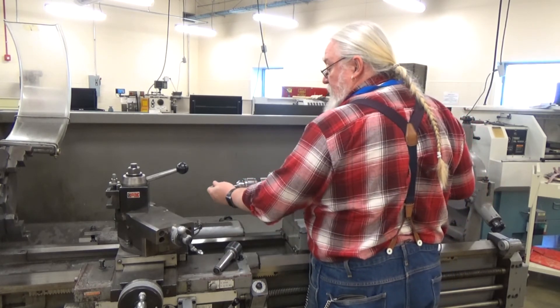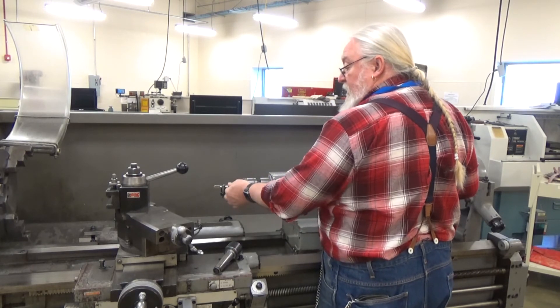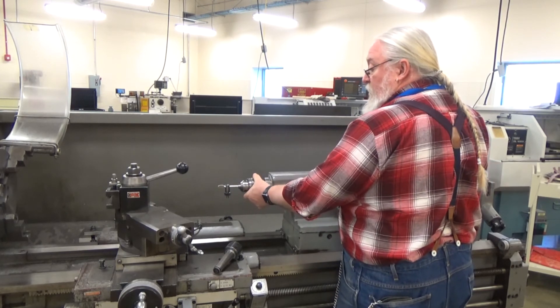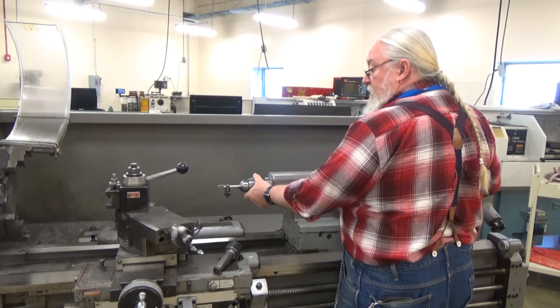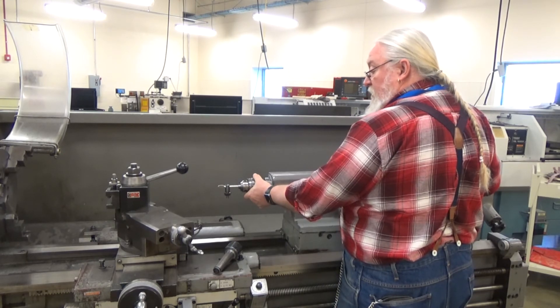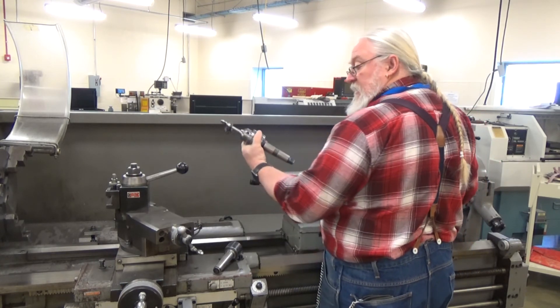In the end of each of these Jacob's chucks, you'll notice I have inserted the chuck key — that's the way I'd like them kept. To remove, you back off on the tailstock until you feel it solid, then you give it a quick jerk. That'll release that.